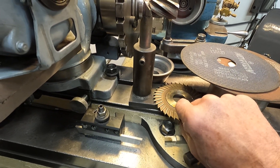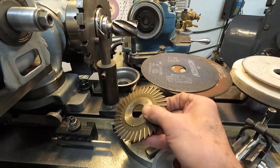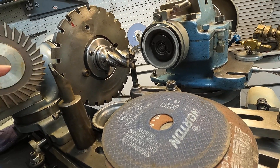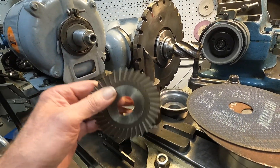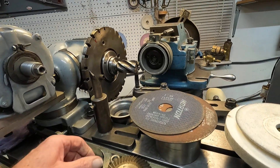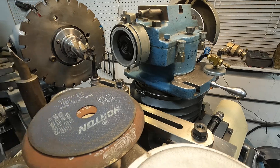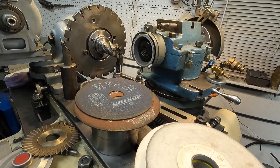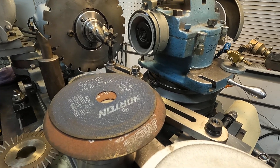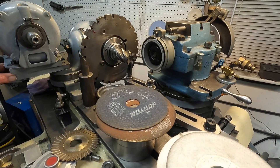For the horizontal milling machine, here's a regular wheel cutter — it's an eighth-inch. You sharpen it with the two-thread tooth rest mounted to the table. The tooth rest is mounted to the machine and it'll hold the wheel so you can get the grinding wheel in and grind that tooth. You unlock it and rotate it — that's how you do a heel.